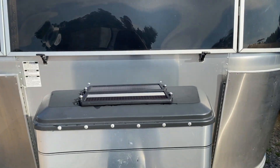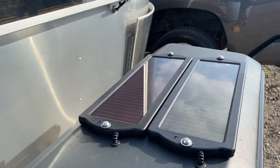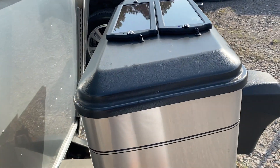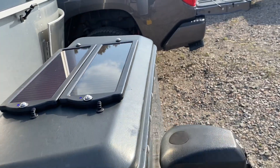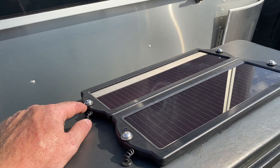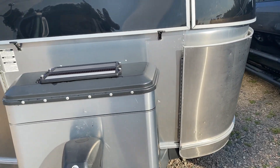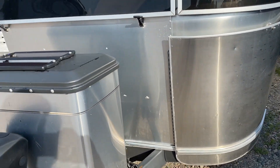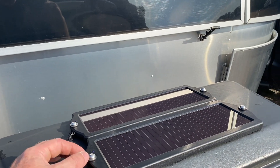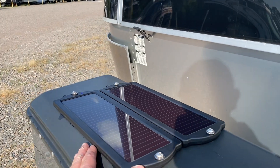To maintain the longevity and quality of my batteries and charge them on solar days: $15 and $15 for the panels gives $30, the charge controller was $20 giving $50, $12 in extra cords gives $62, and about $20 in hardware. So for well under $100 — less than $80 — this system maintains my batteries while storing them. That's less than an $80 investment protecting the $800 worth of batteries I have in here. And other than a couple of small holes in the plastic lid, I've not touched the skin of my Airstream.